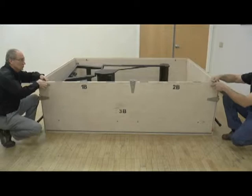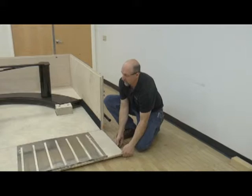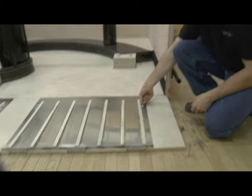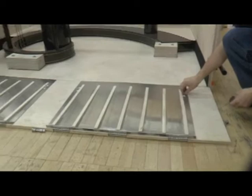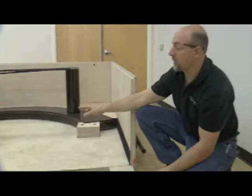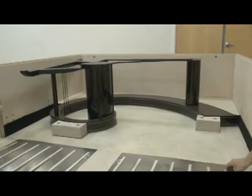Watch your fingers as this ramp comes down. The two stainless steel ramps are held down by four wing nuts — remove the four wing nuts and flip your ramps over. There are also two locking blocks, and you'll need the same three-quarter inch wrench to remove those two blocks. Be careful, as everything is on a tilt and the base is on wheels — you don't want it to roll away. Have somebody hold the base after those two blocks are removed.